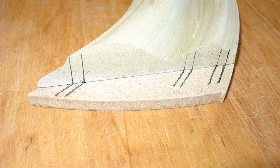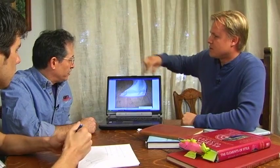And here, now, if you were to lay this out the way it's described in this book, you would use a compass and draw out all the different circles that would be at all these points. Instead, just to simplify it, I just drew a series of dots and slid this piece of molding along. So he basically took all these intersection points here and just found a fair radius, right? That would hit all those points. Right.